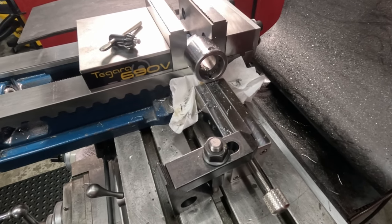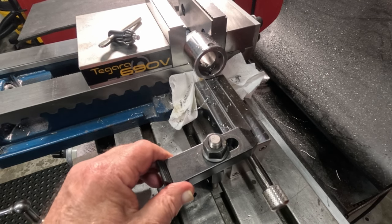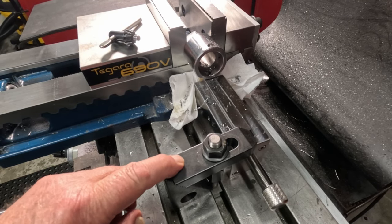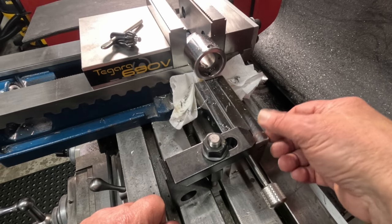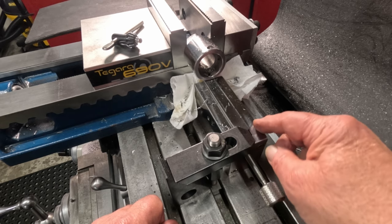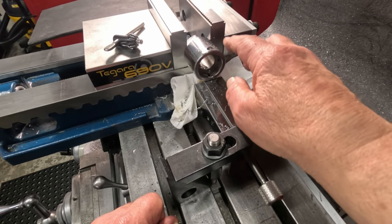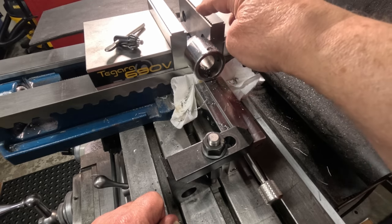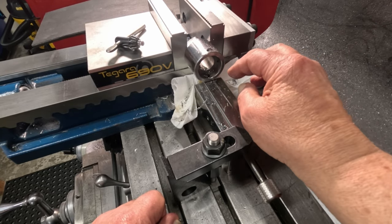See, can you see that? Yeah, okay. See, I put a tilt clamp here, clamp down to my jack here that I made. This is like a planer jack. It goes up parallel with the base. It helps hold this in, because I'm only grabbing it a little bit on this hex here. I want to make sure it didn't tip down on me.